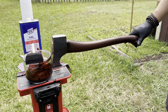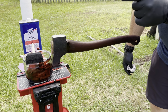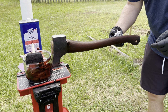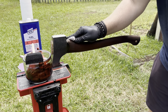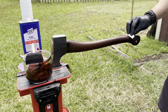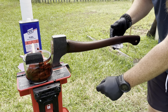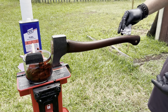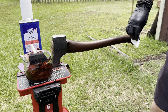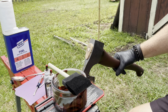A bit of advice: if you're outside sweating, make sure you don't drop sweat on your handle — it'll actually take off the dye. This dye is susceptible to water, so before you treat it with a top coat, keep water away from it. If you get any water — spitting, sweating, whatever — a drip will literally take the dye down with it. If that happens, just take the brush and go back over it in that area, then wipe it down with a paper towel.